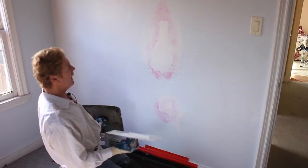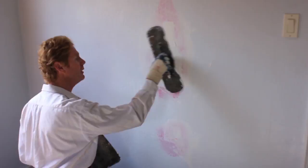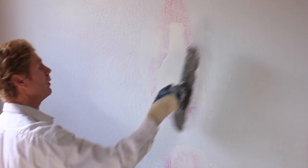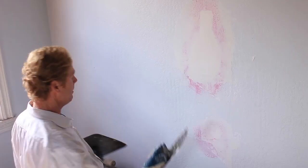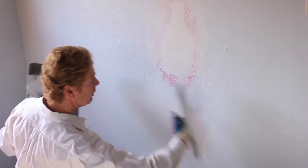I gave that actually about 15 minutes. While the mud is still a little loose, I'll come in here and get out some of the holidays — make it blend in. What I want to do is blend the sides in, because if you blend your sides in real well, that's half the job right there. Feathering in is the most important. So we've got that done. Now we look at this wall here — this is a light skip trowel finish done with a pan and a big 22-inch trowel. You just pull it sideways, but I can match it with this.